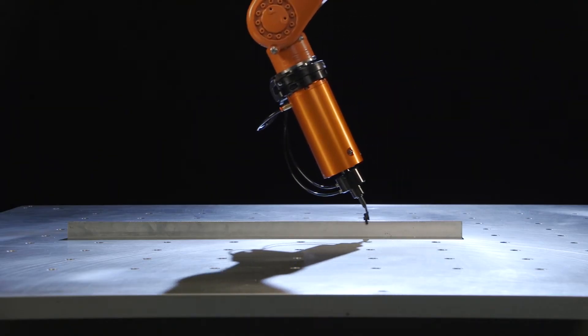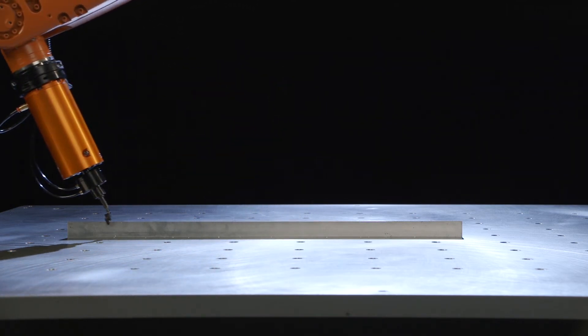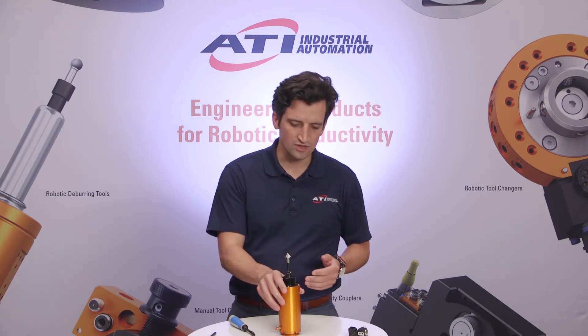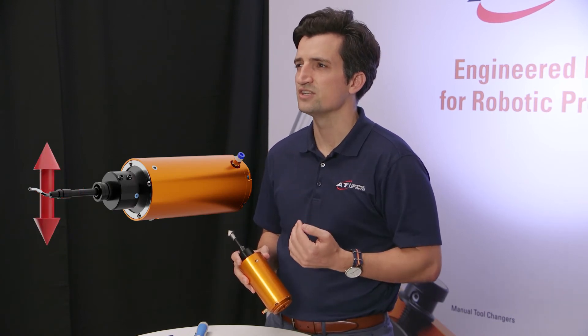There's no motor in this tool. The blade slides or scrapes via robot articulated motions. Air energized compliance allows for variable cutting force. If you need a lighter touch or want to push a little harder against a tougher material, you can. A quick turn lockout changes the compliance motion from 360 joystick-like motion to a single-axis pendulum-like motion.